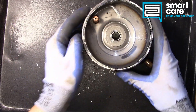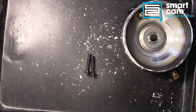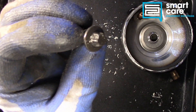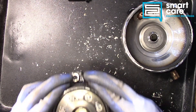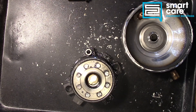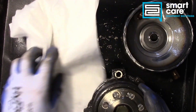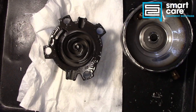We've got the top here with a couple of bolts — these are inverted Torx, so you need a security socket to get them off. The Torx head comes out of the bolt, requiring a security socket. Now we've got the top part of our scroll assembly here. There's a ton of oil in this, so let's get that set on something to soak it up. Now you can start to see the scroll mechanism.